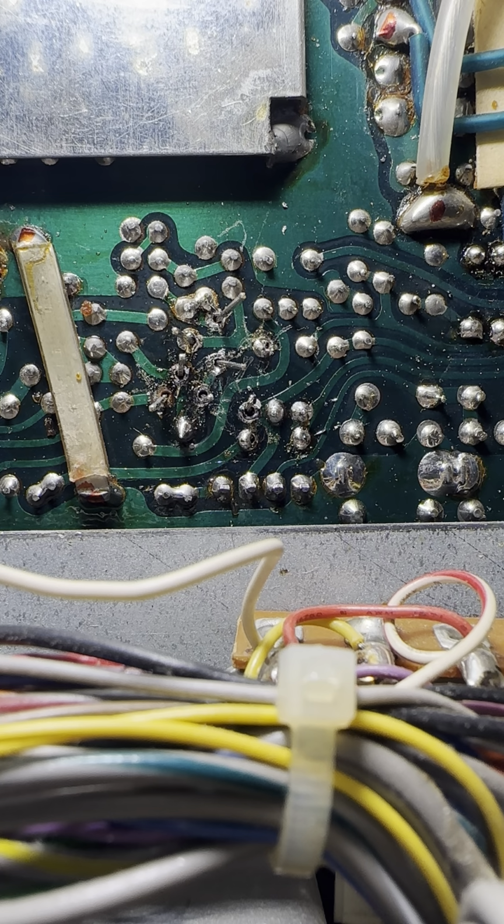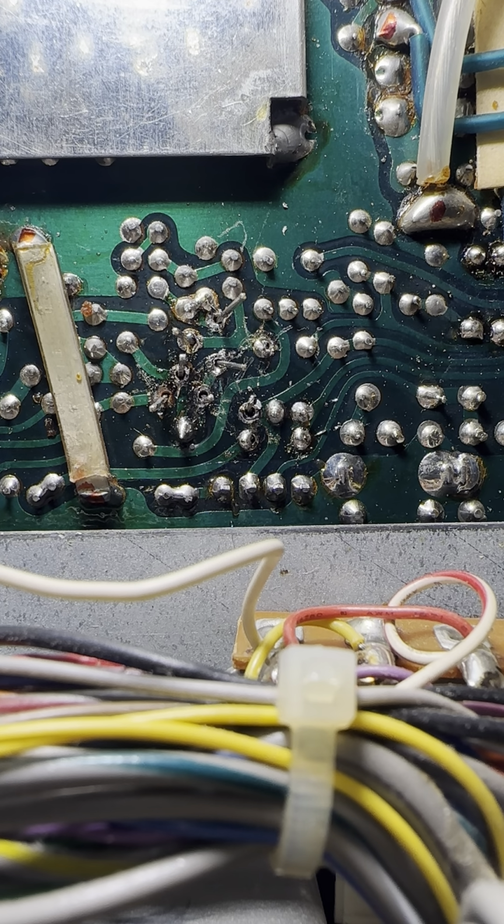All right, grounding to the tip. Whoops. Grounding to my iron body, which is probably hot. Grounding to the radio chassis. There, that means I won't have any strange currents flowing when I hit those things with solder. You don't want to have any trouble.